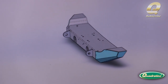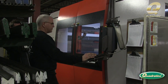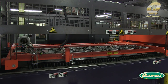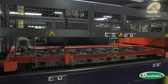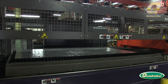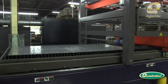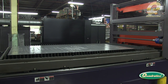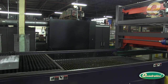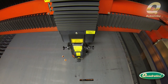All of the products made by Highline Off-Road are designed and engineered using SolidWorks 3D modeling software. The cutting program is loaded onto the Bystronic 4,400-watt laser. This laser cutter is a fully automated machine that can run 24 hours a day without an operator present. A 4 by 8 foot sheet of 3/16th inch thick raw steel is loaded onto the moving cutting table, then moved into the cutting area of the machine. The 4,400-watt laser cuts two bumpers from each sheet.